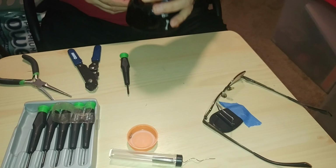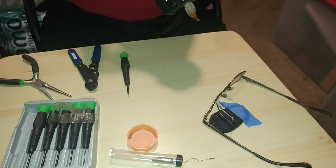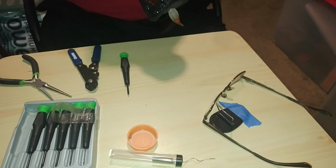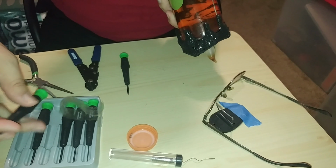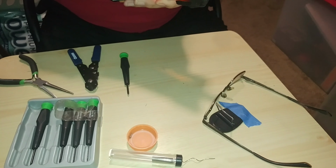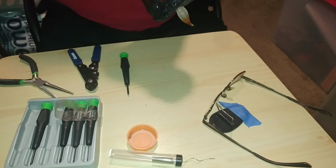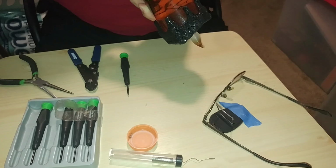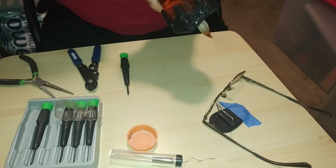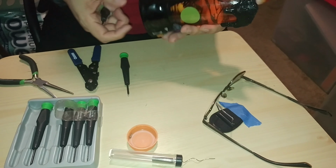And then later you'll see me messing around with the connection between the battery and the post that carries the electricity to the motherboard. And there was a gap in there. And so I'm taking the screwdriver and sticking it between the battery and that connection. And then it lights up, as you see right here. So then I discover that was the actual problem of the electricity not getting to the board. It's kind of out of camera shot, but that's what's happening there.